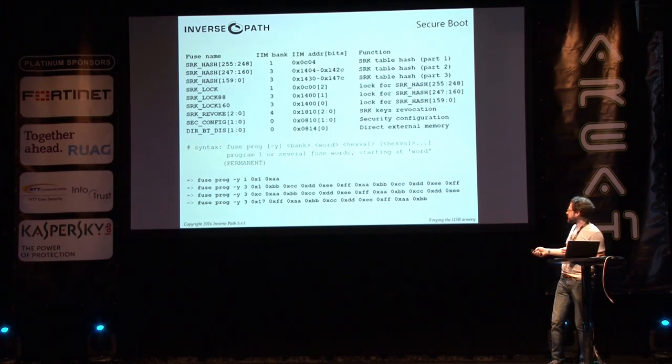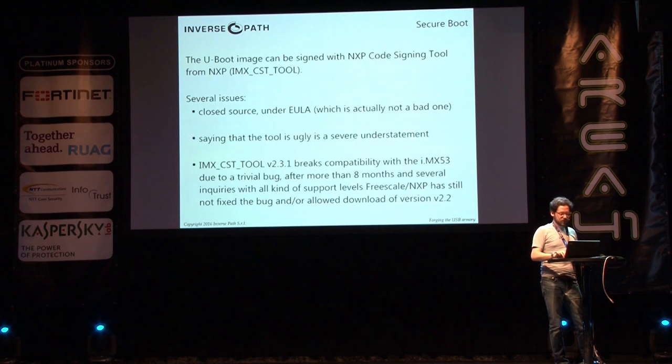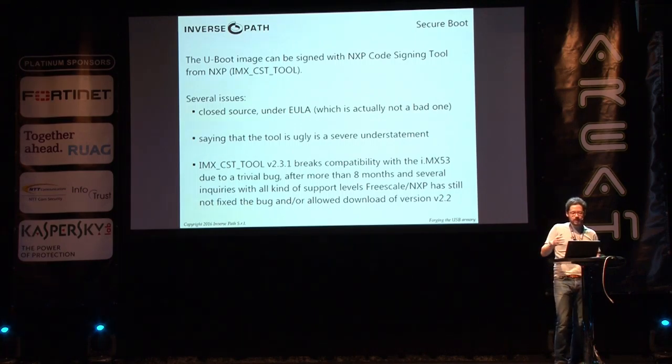So you have certain parameters in the register of the system on a chip, over I2C. These are the commands that you can invoke from the bootloader: you can fuse the hashes of the public keys that you want, and then you can enable and lock them. In order then to sign an image for secure boot, for this high assurance boot, there's a tool from Freescale